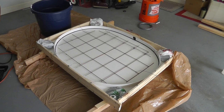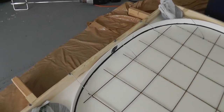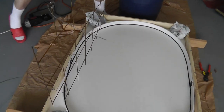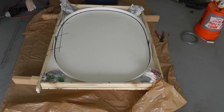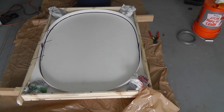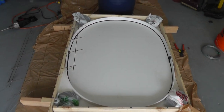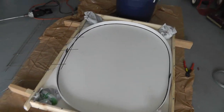Here's the frame. I have the rebar in it, cut it to size, and put these little anchors on it. What I'm going to do is fold this back, then mix and pour the concrete, then flip it back and extend it through there so it doesn't drop down. Right now I'm going to clean the form with some rubbing alcohol so it's nice and clean. There's nothing for the concrete to stick to because that board needs to be clean so there's no issue with the concrete coming out.